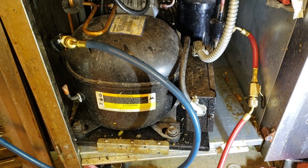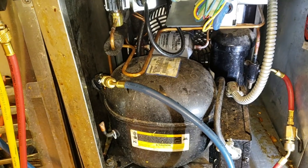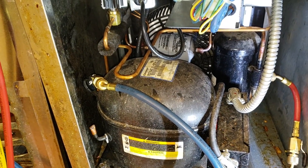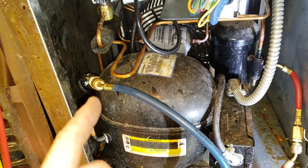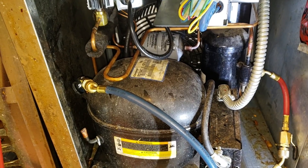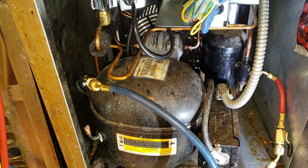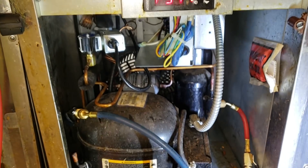You need to be 500% sure that your welds are good. You cannot rely on a nitrogen pressure test alone to make sure your welds are going to hold. I'd like someone to tell me how I'm going to get back there and fix that dryer now that this thing's all back together if there's a leak on that dryer - it's not going to happen. I had to take this apart in pieces and put it back together in pieces. The dryer was the first thing to go in. I'm 100% sure my welds are not leaking on that dryer. You have to be confident on that. It's just not very practical to do a nitrogen pressure test on something like this.